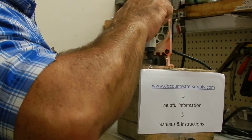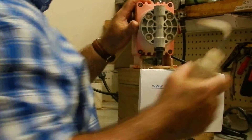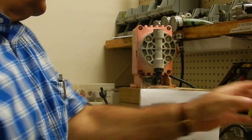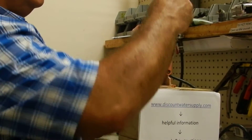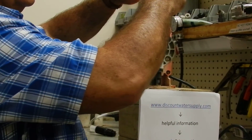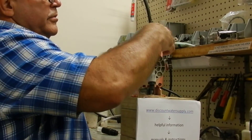Tighten so you don't get distortion. We'll need to prime the pump, which means removing air from inside the pump with liquid. This is my special priming fluid, also known as water. Put the top on, then put the top tube adapter in, and your discharge hose. If this metal ring is rusty, replace it with one from the kit; otherwise, you have spare parts.